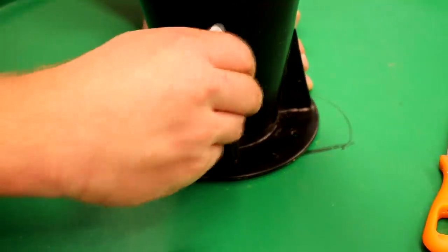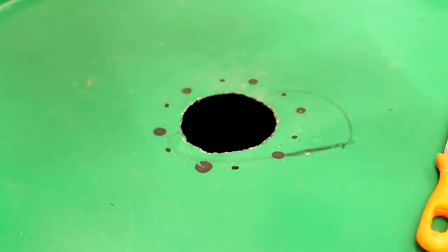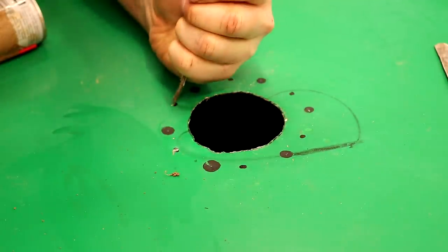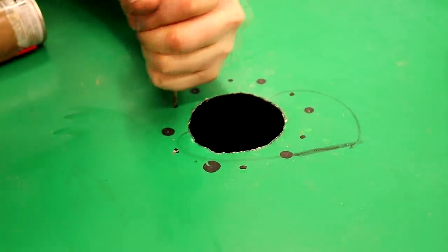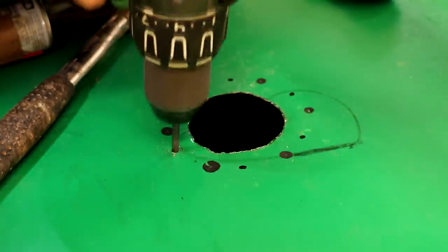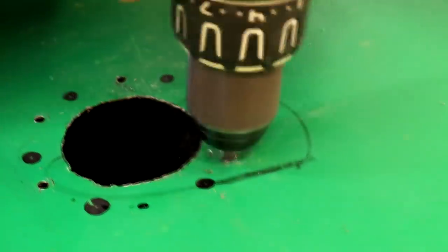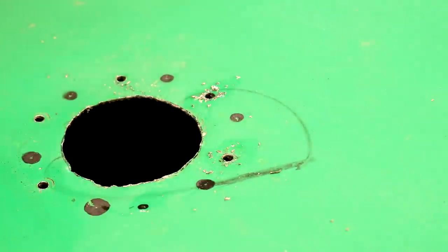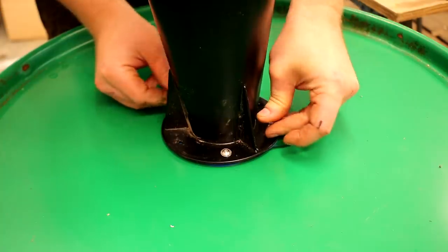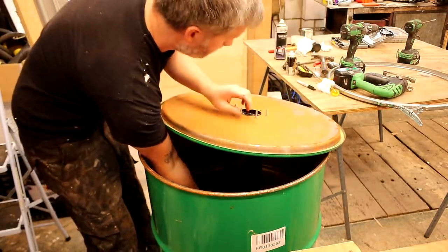After the failure of my spray paint idea I decided to just use a marker pen to mark up the holes to mount the cyclone to the lid more accurately. I then punched a centre hole using an awl, which creates a small divot and that will help me to locate my drill bit without it skidding around. I drilled the holes with a 4mm bit. I could then add the rubber gasket and the bolts. I turned the lid upside down ready to add the washers and nuts, reusing the ones that came with it.